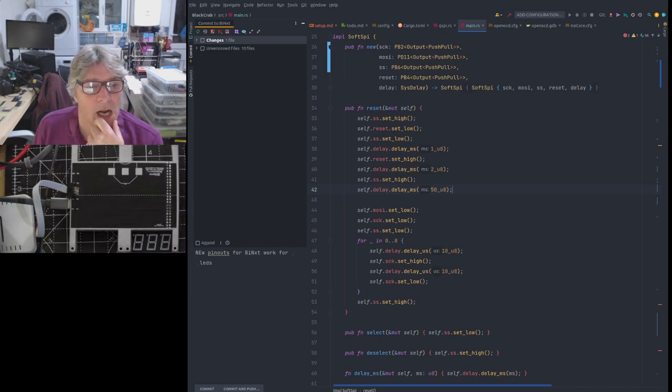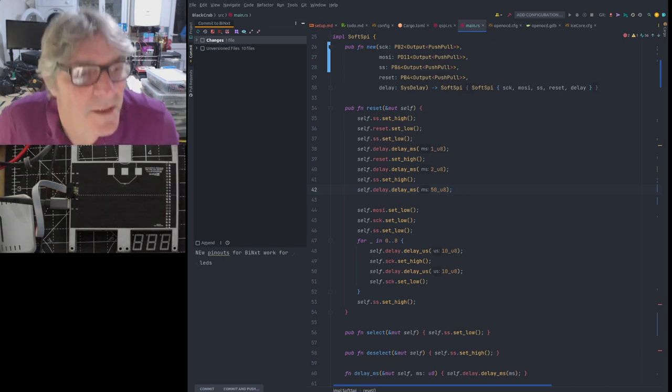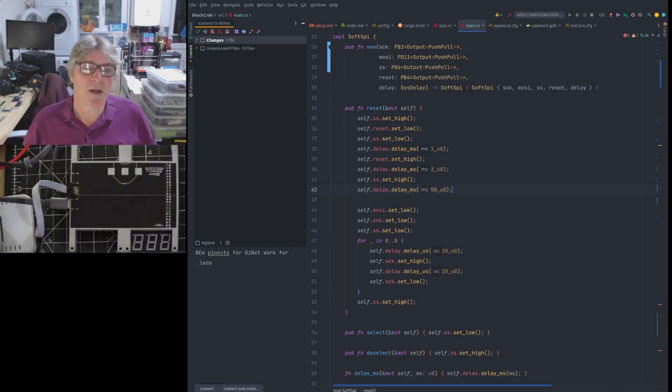So I was then thinking, well, how do I solve it? I've got another problem as well. Say I found a way of doing that by faking a load of dummy cycles. Now, forget what those are for the moment, I can explain it later. But if I was to send an empty transaction that just had dummy cycles in, that were long enough so that I could time a reset pulse in there, which would be difficult because that would be a spawned process.